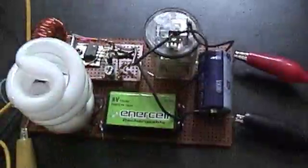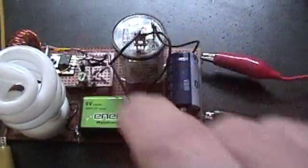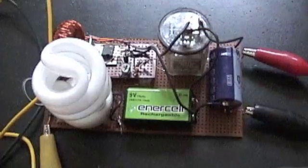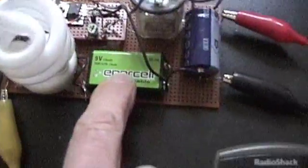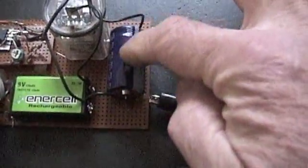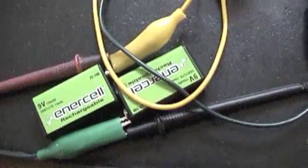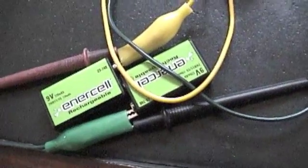So again, this electronic flasher gets replaced with a hall effect sensor on the alternator, so it would kick in once per RPM. And this cell gets replaced with a much larger cell — probably 6 volt. You could double, triple, or quadruple the number of these if needed. My guess is this will be a 12-volt battery pack because it's probably the most useful — simplest for inverters and simple tools.